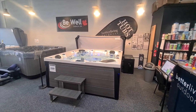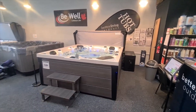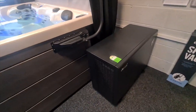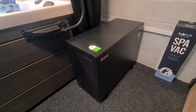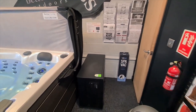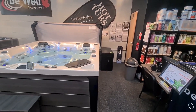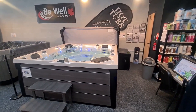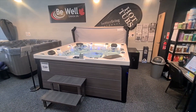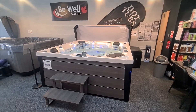Hi, it's Jeff from Better Living Outdoors. Today we're going to give you a catch-up on our heat pump experiment with our new Mr. Silence 7 kilowatt air source heat pump. Conveniently the heat pump is running right now so you can hear the noise. It is a quiet unit — compared to the other ones we've experimented with in here, this is far quieter. I can hold a telephone conversation very easily with it running in the background. That's on its normal running mode. There is also a silent running mode which reduces efficiency a little but is whisper quiet, and a high power mode which improves efficiency but gets a little bit noisier.